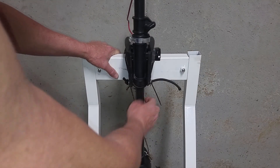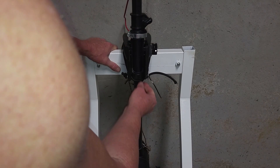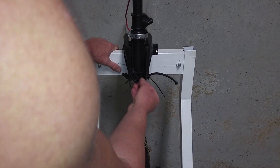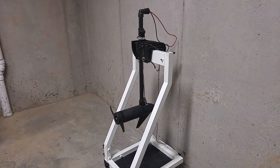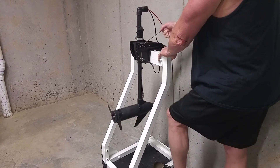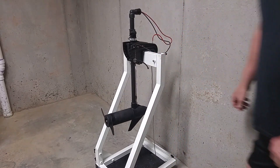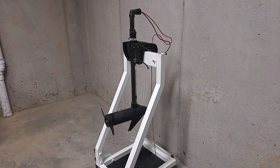So this is what it is. And if you go too far back, it pops there, but it'll be enough to keep everything working. Now I'm going to show you that with everything installed, the motor will still go up and down very easily. The shock cord works a lot better. I was going to try using a spring, but to get the right tension, the spring has to be very tight against the trolling motor shaft and that causes it to scratch and damage it. So that's why I went with the shock cord. Eventually it'll wear out, but it should last you a long time.